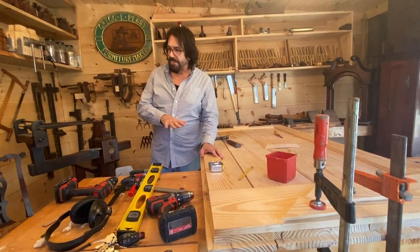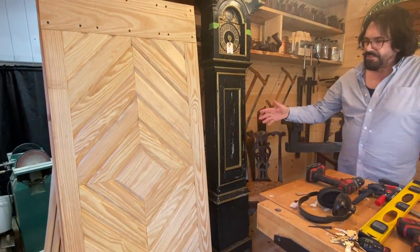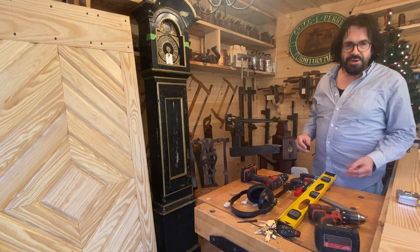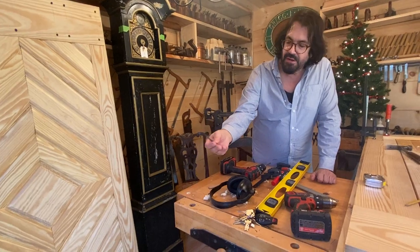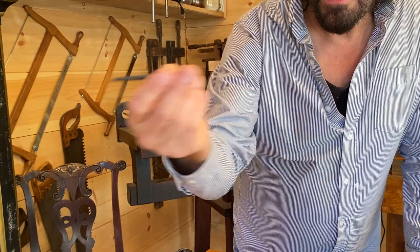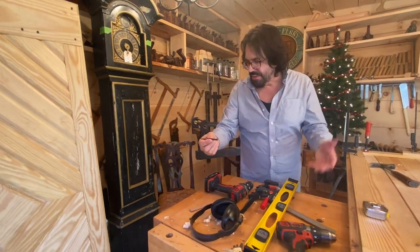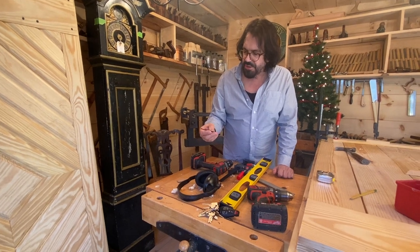This still has to have its nails put in. We need to pre-drill these guys, because if you don't, you're going to blow the back out. This yellow pine is very durable but very brittle. As the blunt tip of the nail comes out, that last eighth or sixteenth of an inch is going to blow a piece of wood out — could be an inch by an eighth inch — and it's unsightly. So we're going to come through and pre-drill all these guys.